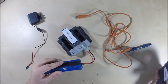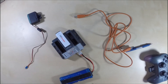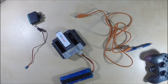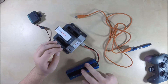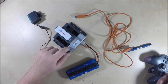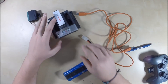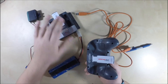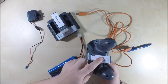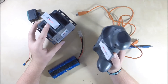There's also a power input, an on-off switch for the cortex, and a battery backup port. The battery backup uses a 9-volt battery, and during a game, if the main battery dies, it'll prevent loss of connection between the two units, avoiding problems with your robot. Don't drop any of this — it's all really expensive and very delicate, so be careful.